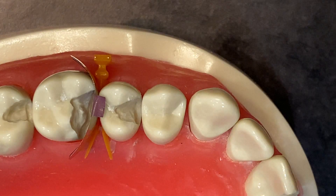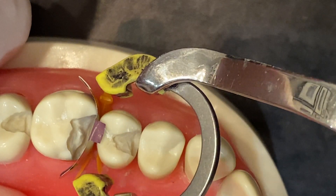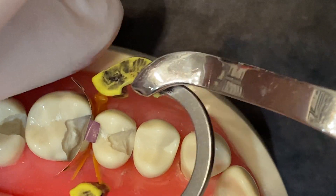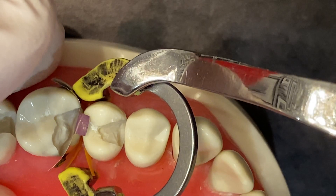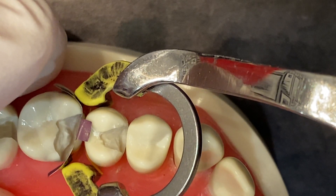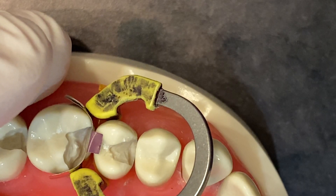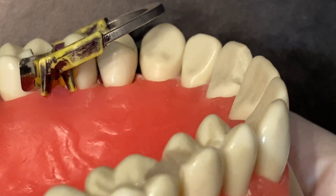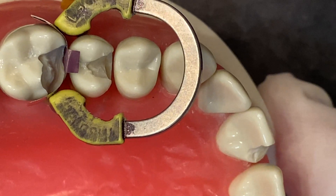For this particular case I'm going to demonstrate ring use with these Versa wedges. These are designed to be compatible with ring systems — the popular ones, all of them. It's designed to fit over the handle on one side, and then on the other side you're going to allow that ring tine to come in between the wings of the split wedge. That's going to allow the ring to engage with the wings of the wedge and not crush your wall.